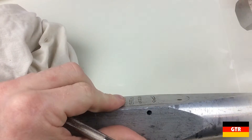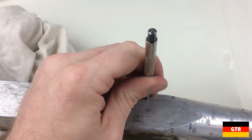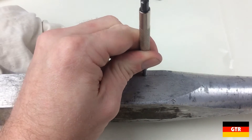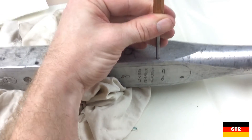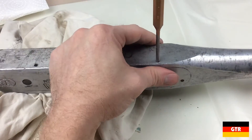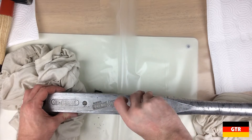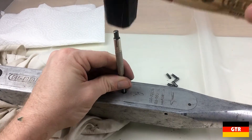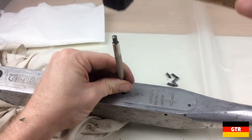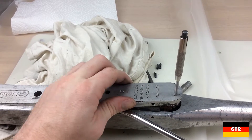Because this wrench is so old, and because it would be fun, I decided to go through this to ensure there are no issues with any of the internal mechanisms. There looks to be 4mm roll pins used to attach the nameplate. To remove these, I needed to punch one side to push both through the same end — you need an especially long punch to do this. Even after taking out the roll pins, the nameplate still would not budge. I suspect the housing may have been bent, causing some binding. I decided to punch the three tapered pins out so I could punch the nameplate out from below. It was a pain, but I was able to pry it off. I probably should have used some heat to help with this — I don't think it was supposed to be that difficult.